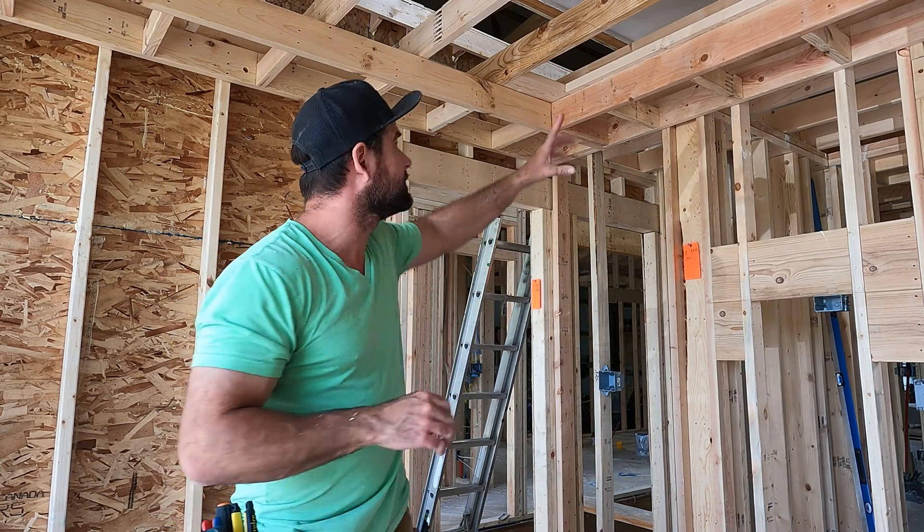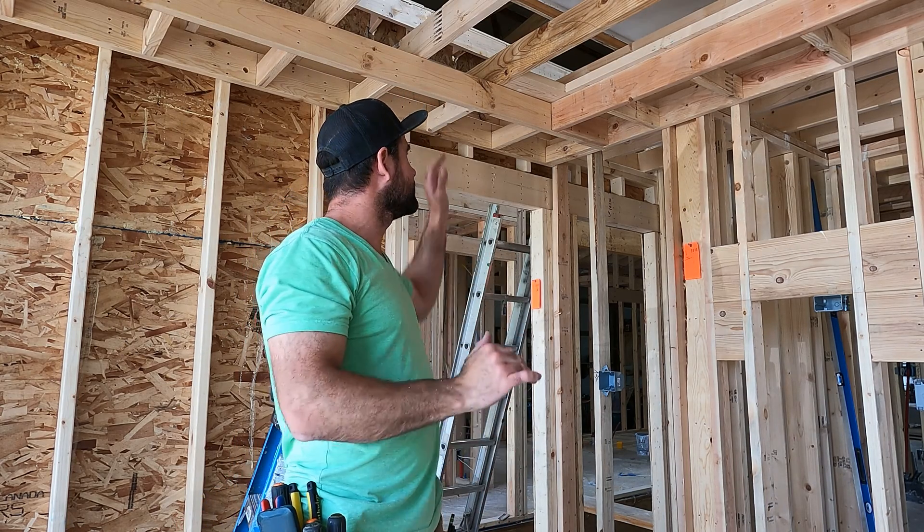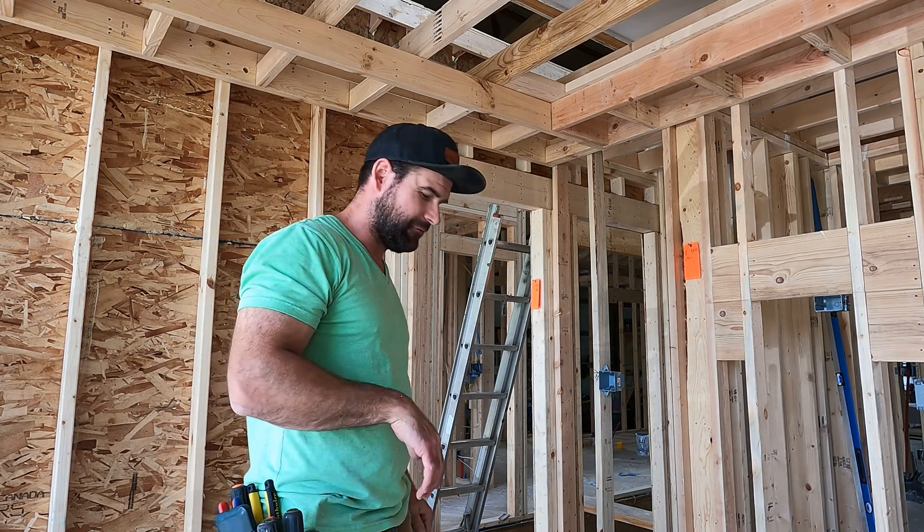I don't have a lot of holes to drill because when I built the soffits I made them with two-by-six faces but two-by-four supports, so I had a built-in gap. I only have to drill holes really where I come in and out of the wall, which is great.